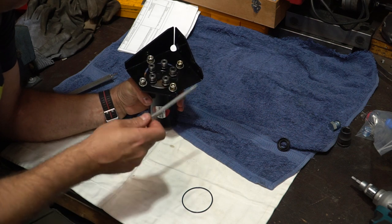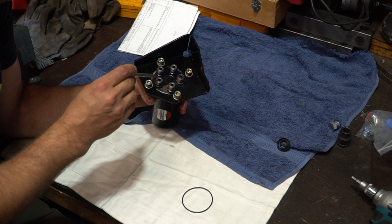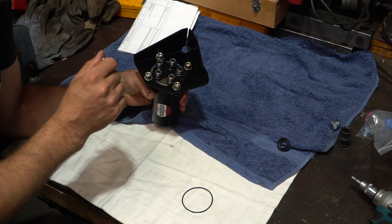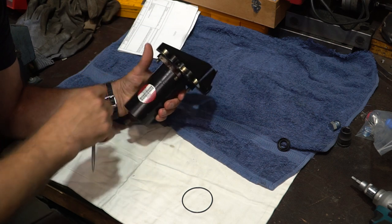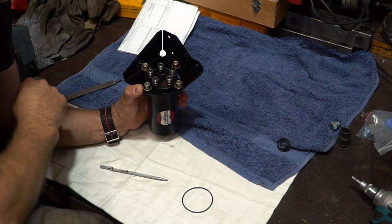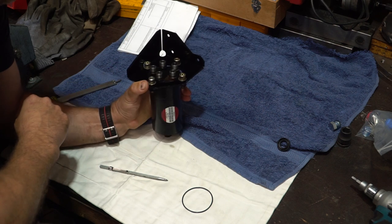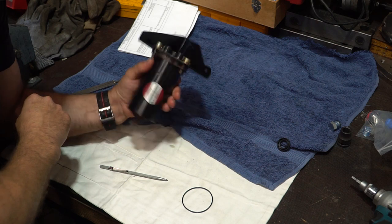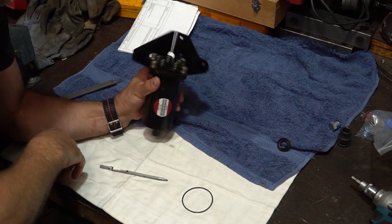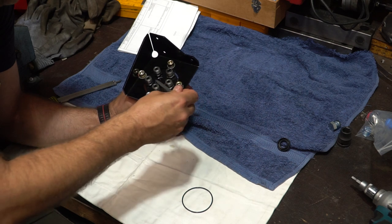And maybe the most interesting difference at this moment is also that a couple of these fittings in this unit in the Toro are one size bigger, and these fittings, I guess they are not fittings, they are some kind of stud bolts inside the Orbitrol. You can see it from the picture, so we have to remove a couple of those and take the fittings from that old one, I'm guessing so. And then we have to have our fingers crossed that otherwise this type code would be the same and there wouldn't be any pressure relief valve settings or something like that that would be preventing the functionality of the machine.